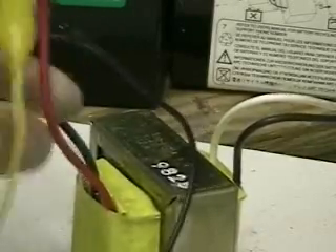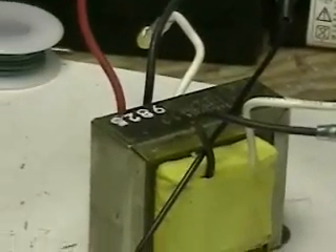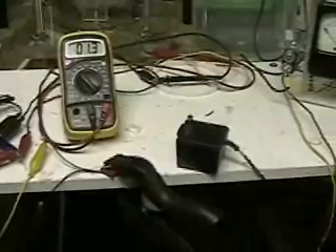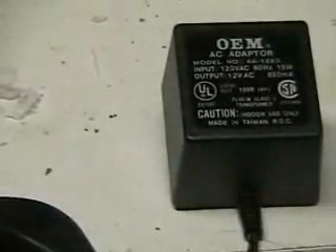And that's a good thing because we don't want the amperage. So what we're doing here: we've taken a small transformer, plugged it into the AC outlet. That transformer puts out 12 volts AC. We're running that AC through the other transformer and taking the 12 volts and multiplying it to over 50, going through the diode and charging the capacitor.